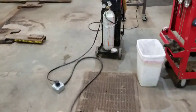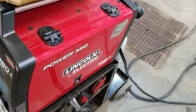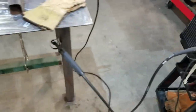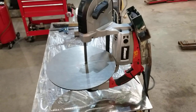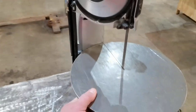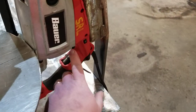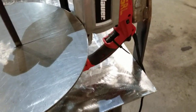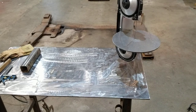I've got a couple other videos I want to upload that show a little bit more about this. I just got a Lincoln 220/180C Power MIG which I do my welding with — it works out really great. I've also got the angle grinder set up with a bracket on a hinge that flips up, the grinder slips down in place, I put a zip tie on the trigger, and that goes down to a switch so I can turn it on and off. That's my welding bench.